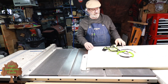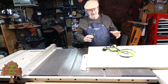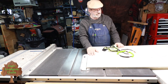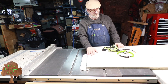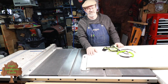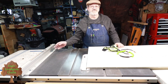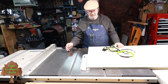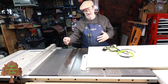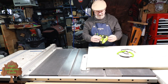I'm going to cut out the piece according to the plans for making up this keyboard tray. I've got my blade raised up to make the correct depth of cut on this three-quarter-inch piece of plywood. It looks like cabinet grade — it's really straight so I'm going to use that. To start, I'm going to cut a width of 20 and three-eighths inches, which will be the width of the keyboard. Then I'll make more cuts as per the plans to get the angles and other cuts I need. Right now I'm just going to make this one cut, so let me get my safety gear on.